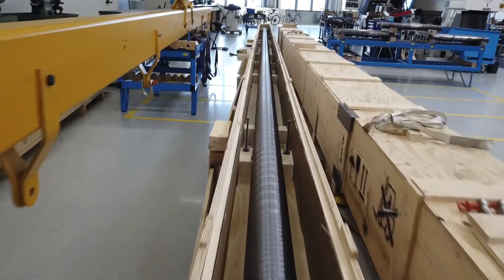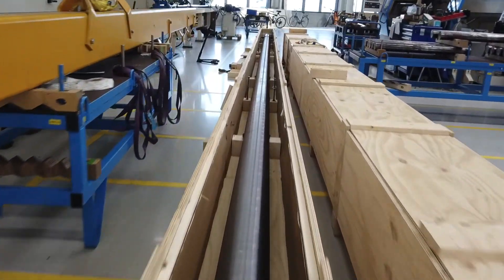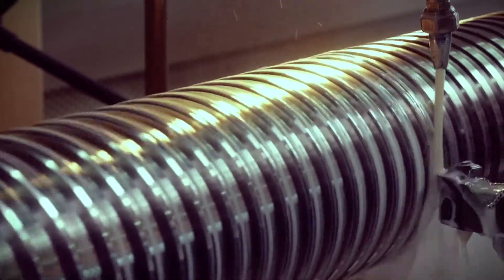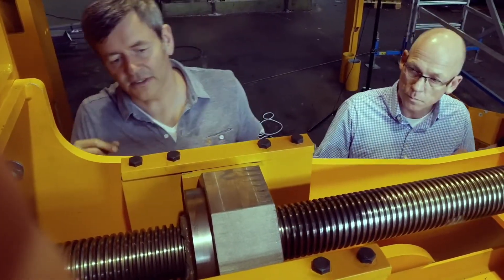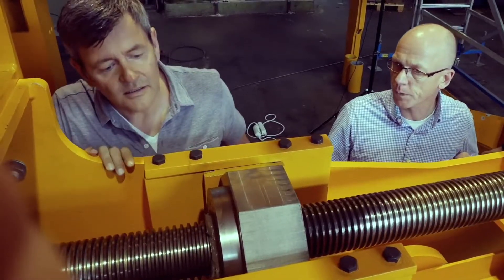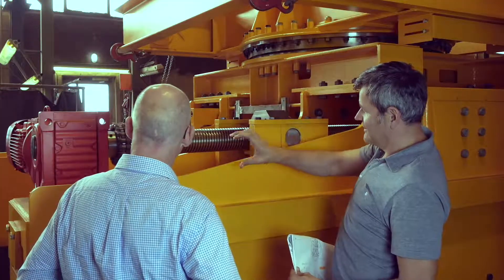The surface of a screw in a machining component should not be too smooth, because otherwise — imagine you take two sheets of glass and press them against each other — every liquid is squeezed out between them. That's exactly what happens between a screw and a nut in a lifting jack, for example. You don't want the lubrication to be squeezed out; that's extremely dangerous and can lead to the stick-slip effect and cold welding of your complete application.